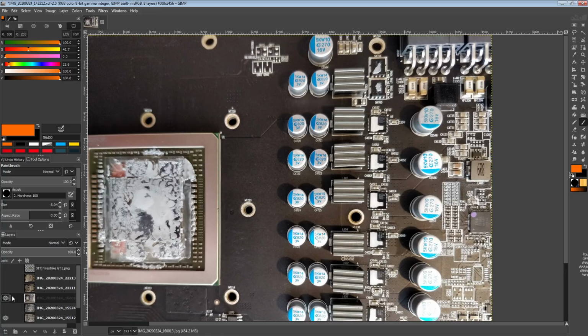So yeah. I find it really interesting to actually get a measurement on these results. At the same time, I'd really like to test some of the Strix cards, because on the Asus Strix card, you've got your through holes, and then you've got a bunch of SMDs as well. And they don't even use regular through hole caps. They use this can style of capacitor with an SMD mounting end. So they're no longer through hole.